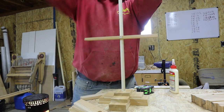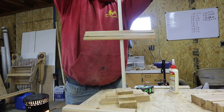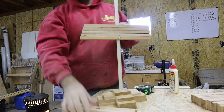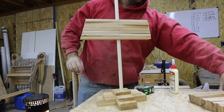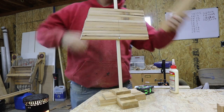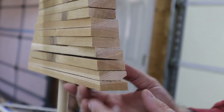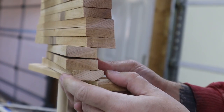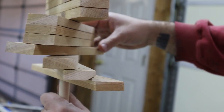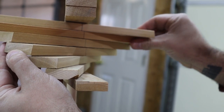If you wanted to make this base a little bit bigger, you could use a four by four and drill a three-quarter inch hole in it so that it slides down over the trunk completely — it'll give you a beefier looking trunk. These pieces at five-eighths of an inch with a Forstner bit do fit on there fairly tight. Once you have your tree completely assembled, you can go ahead and give it a spiral look by twisting the slats so that they slightly overlap each other on each layer.